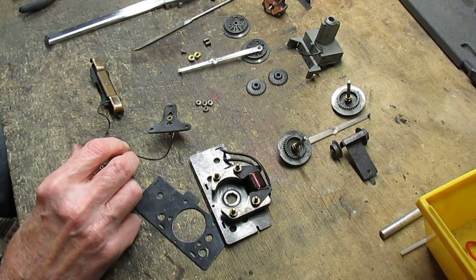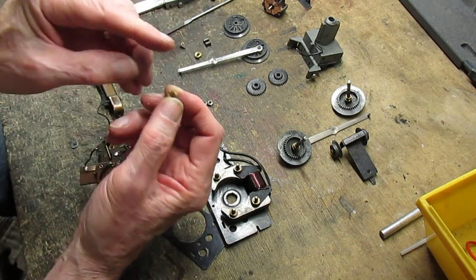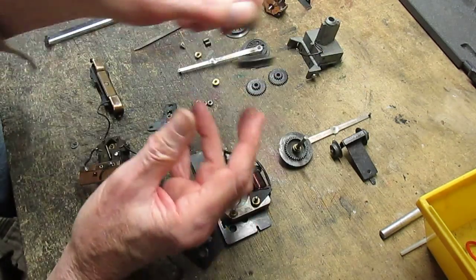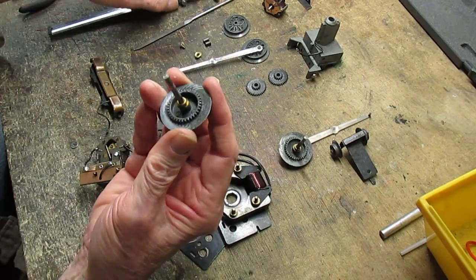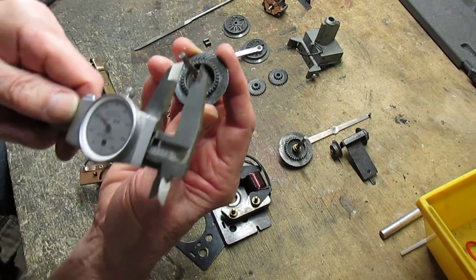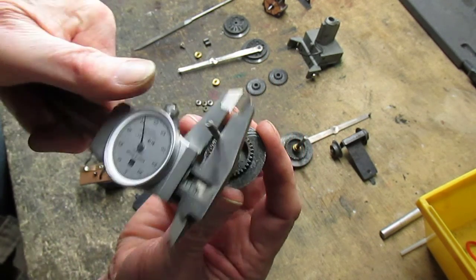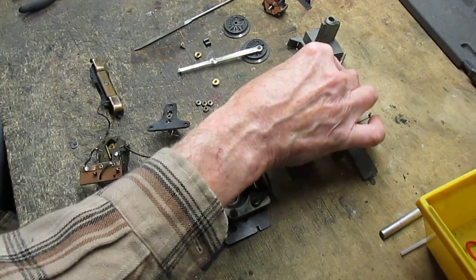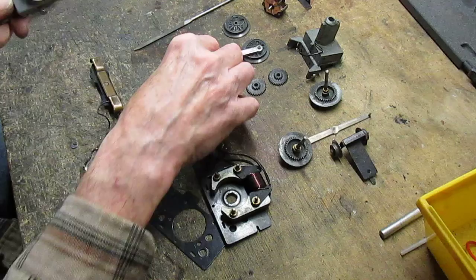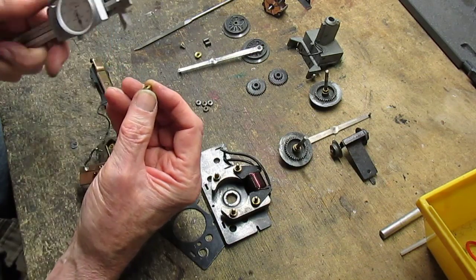The other thing we check are the axle bearings. Here's one right here. And here's an axle. All the axles for post-war are 140 thousandths. And so is this one, as they all are. Usually pre-wars are 135. They take different bushings. So we'll see what this one measures out to be.